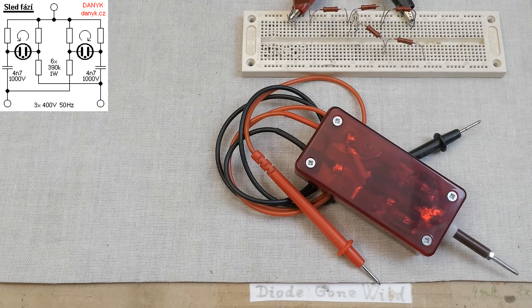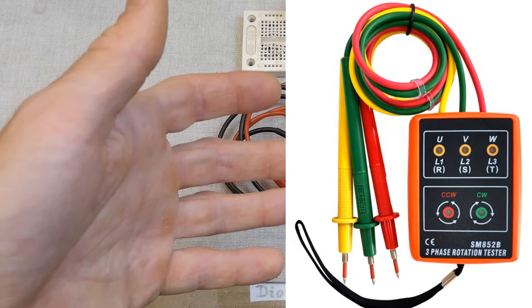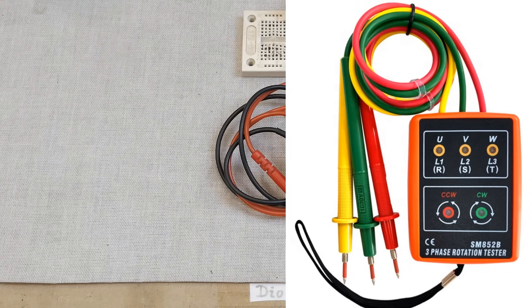There's a link in the description to my website with the schematic, the table, some pictures, and the description of the tester. For completeness, let's also mention a different type of phase sequence tester — the ones that probe into two phases only and neutral. Three-phase testers typically require three hands to hold the probes plus a fourth to hold the tester, because otherwise it dangles on the wires. This version is a bit better because one of the three probes is part of the tester, so you only need three hands.